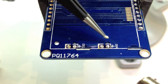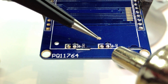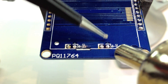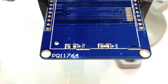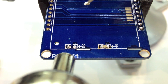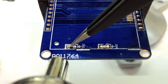So now we're going to seat the new LEDs in here — the green ones. I'm going to heat this solder up a little bit. You can see it kind of get melty — it kind of changes appearance a little bit when the solder melts. Then we're going to get the other one. I'm going to switch hands and do this right-handed again. We'll get the solder kind of melted here, and then we're just going to put this little LED back. We're not worried about perfect solder joints — we want it just kind of in there, and then we're going to touch it with an iron to get a positive contact on the LED itself.